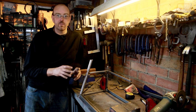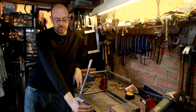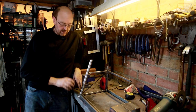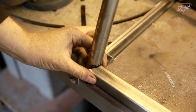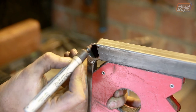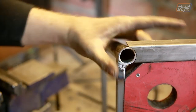When we were doing the roll hoop a couple of people asked about how to do tube notching when you don't have a proper tube notcher — which we don't. I just used a regular grinding disc on a grinder and very slowly notched it out to make it the right shape. This tube is extra difficult because it's also on an angle, not just square up to the side. Line the box section up against the tube you want to notch around and make a rough outline with a pen. Take away all the rough material with a slitting disc — it will make life a lot easier later. Line it back up against the tube and see where you need to take away any additional material. Looking end-on to the tube, you can get a much better idea of where the outline is that you need to take away to make a full through join. Grind the material away and keep fitting up against the tube until you get a much better fit — this may take a lot of iteration, but a good join is worthwhile.